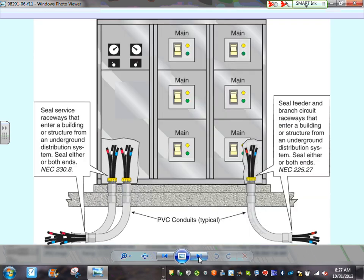Here's a picture of a conduit system coming from underground — you can see the word PVC. When you come from underground to a switchgear, you should use PVC. You can use rigid or EMT, but you should not — PVC is the right choice underground, and as you enter the building you must seal the conduit. For the project you did, underground means PVC Schedule 80; above ground, EMT is best and most economical.